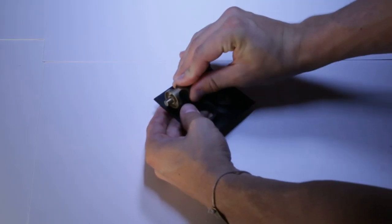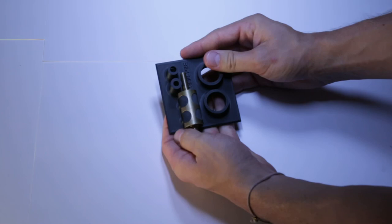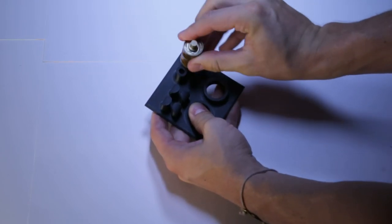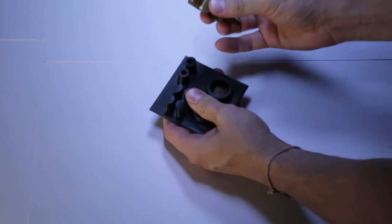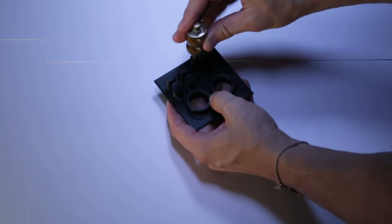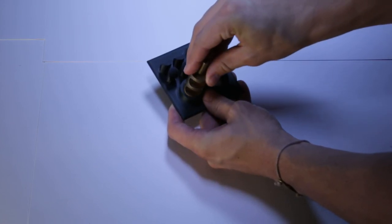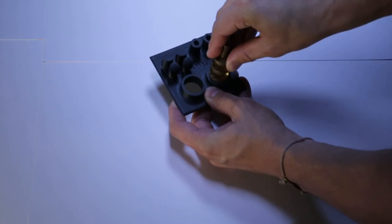In the demonstration video, the first step is to push the part into place — it fits, meaning the outer surface has been manufactured correctly. Next, we test the diameter and length of the longer pin; the bottom is flush with the bottom of the check gauge, confirming the length is correct. Then we check the diameter of the smaller pin, and test the lower bound of both pins to make sure they don't fit in that lower bound hole. Finally, we check the outer diameter — it should fit into the upper bound hole and not into the lower bound hole.